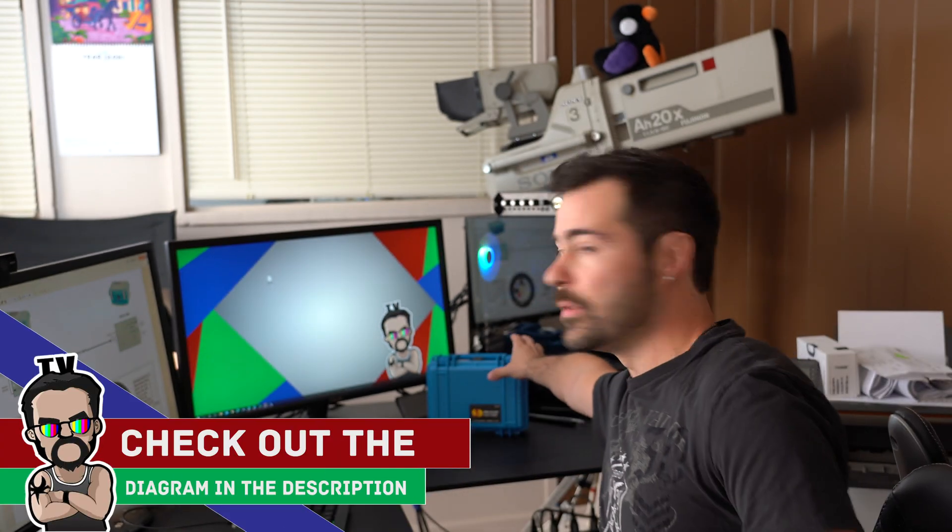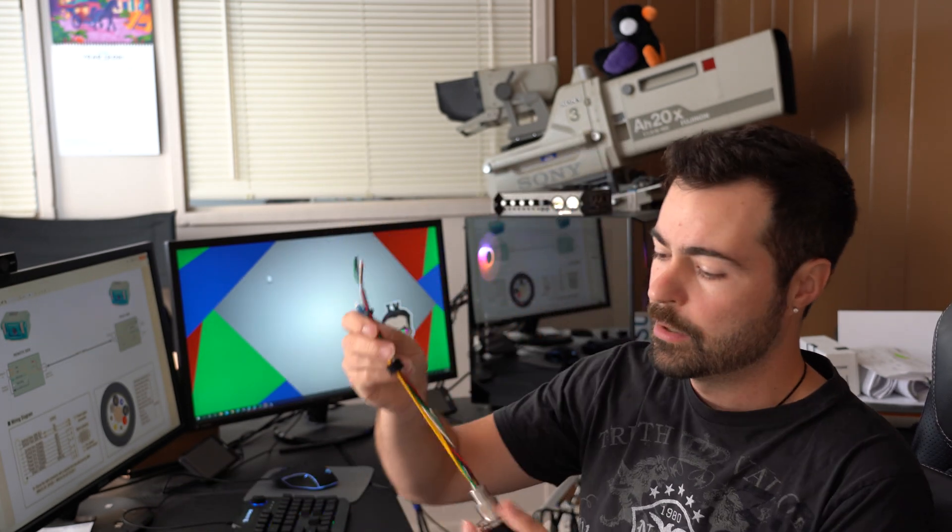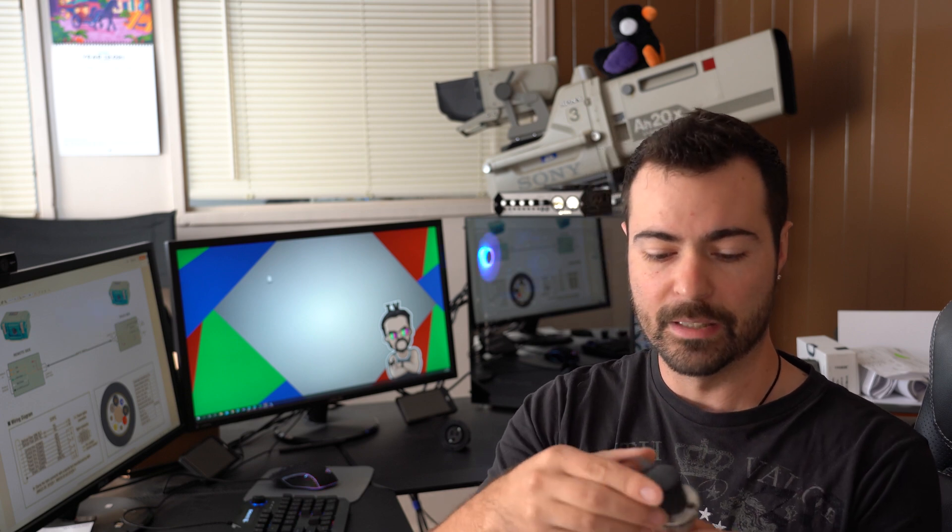As for the actual components we're going to be using: a Pelican case — the 1120 model — very small, nothing ridiculous. We'll be drilling into that so we can mount our Edison plugs on the side for power, as well as an LC feedthrough or coupler from Switchcraft that we can put in the side. And of course the actual breakout cables themselves that will have the LEMO connector for the SMPTE fiber, with the breakout going to our single-mode LC fiber, as well as bare leads which we'll put into the Edison plug. I'll put links to all these parts in the description below if you want to take on something like this.